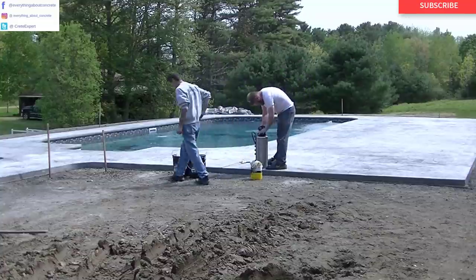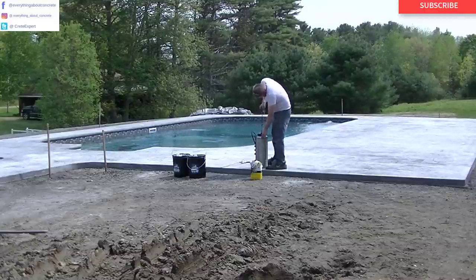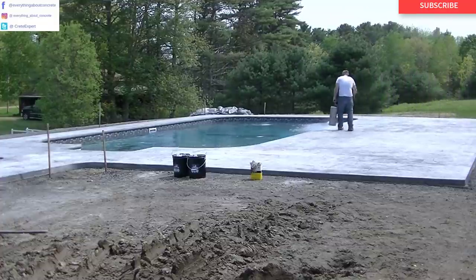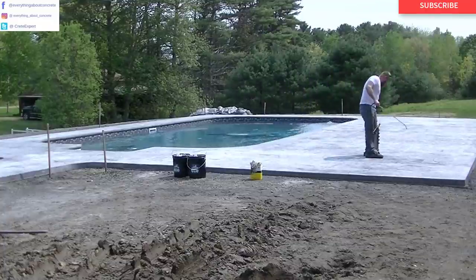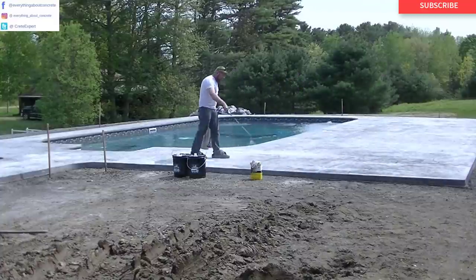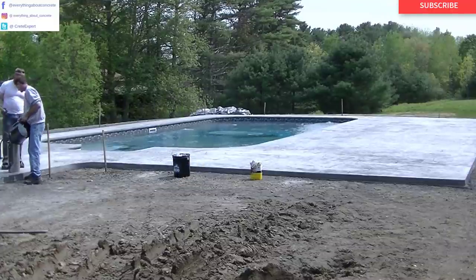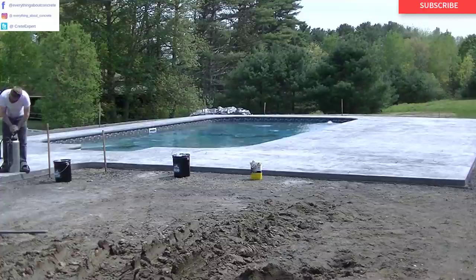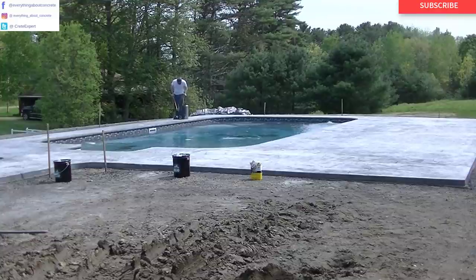I'll have a link for that pump-up sprayer down in the description — if you do a lot of spraying of sealers, that's the one to have. As long as you always clean it out after — we use that can of acetone right there, put in a little bit and clean it right out. If you're using a different kind of sealer with a different carrier like xylene, just rinse it out with xylene or mineral spirits. This is how you seal the deck — just nice light coats, nothing really hard about it. You just need to understand a little bit about sealers, where to get the best ones. I'll have a link for Trinnik down in the description too. You can buy it right online and they'll ship it right to your house. That's it guys, thanks for watching.